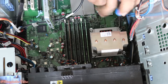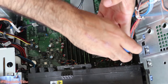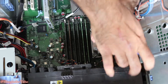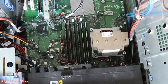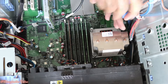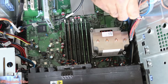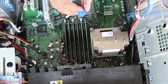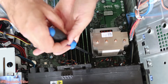Try to do a little bit on one screw, then go to the other one, then another one — don't finish one completely and then do the next. Do a little bit of each one in turn. Don't put too much force, just feel it so that it can't move any further. Double check everything is tight.